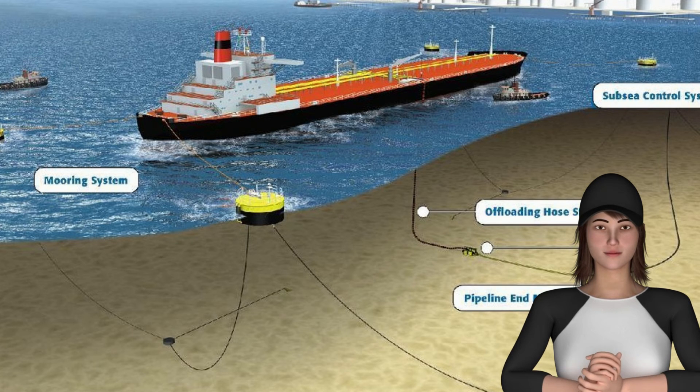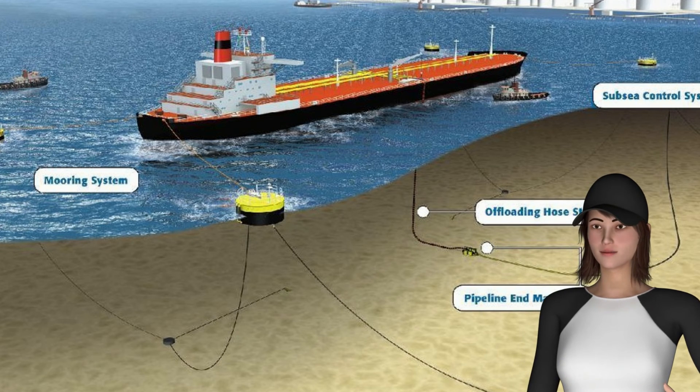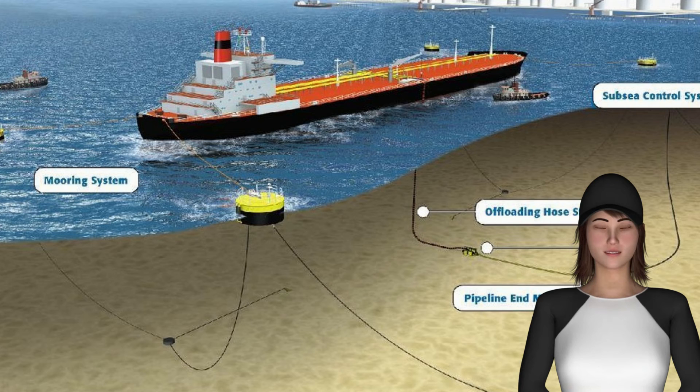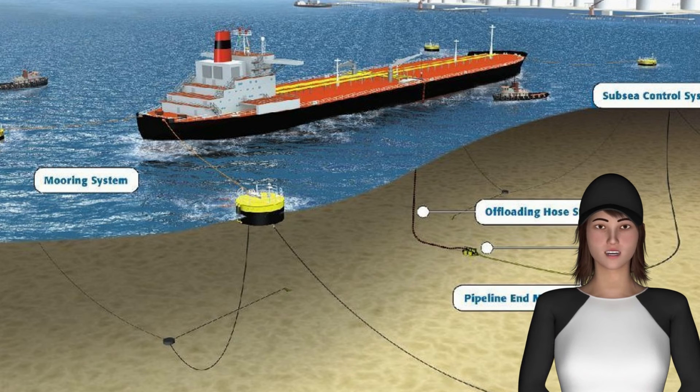7. The helm and engines are to be carefully used during this maneuver to ensure the stern is swinging clear of any of the buoys. Then a set of three mooring lines are passed and made fast to each buoy — one on port bow, one on starboard bow each, and one on each quarter. And the vessel is made fast.